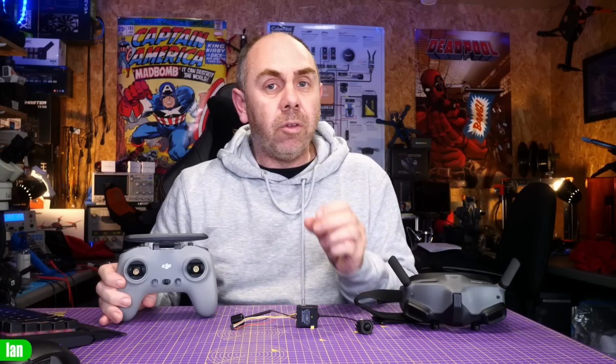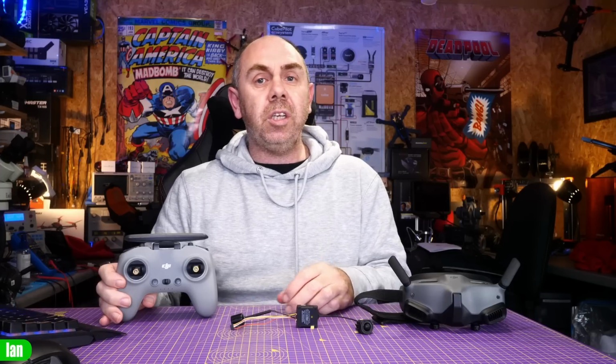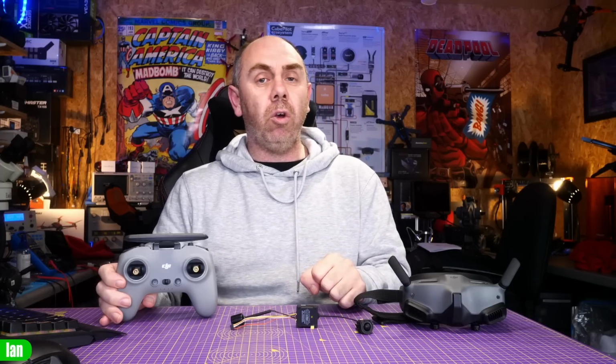Now, the interesting thing about the behavior on the OcuSync system is what happens in signal loss. Whilst the remote and the goggles do have the ability to transmit on 2.4 or 5 gigs, the reality of the way the system works is the second the video signal is lost, you actually drop the control link as well.